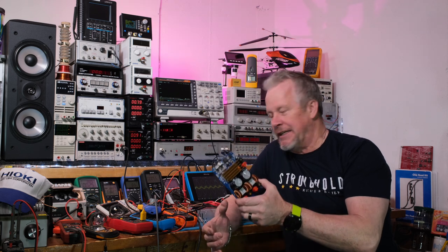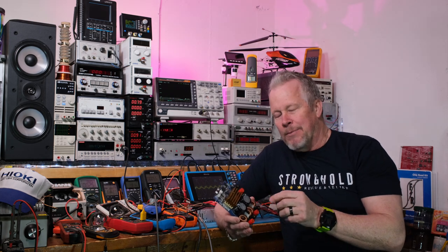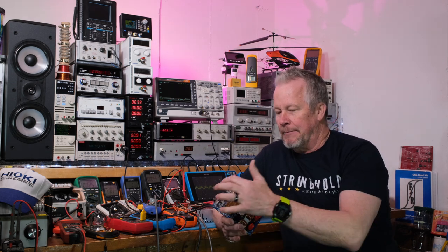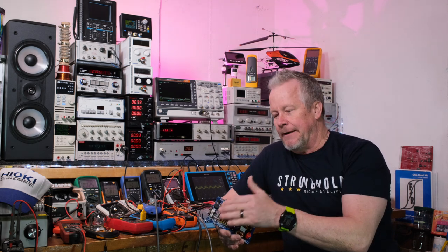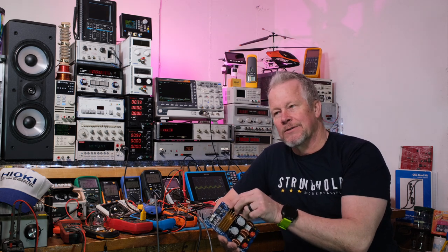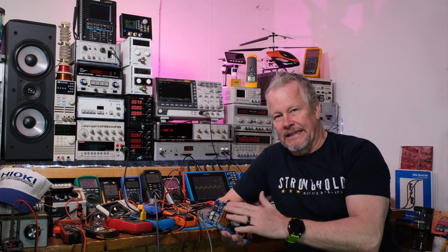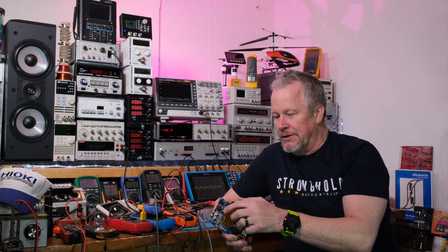I showed the data sheet on this. We've got the switching power supply and we're going to power this up. Here's the thing: when I had the signal coming into these RCA jacks and my THD meter connected, I read a certain THD — then when I applied power to these terminals, I saw the THD go up. That's telling me the noise is being generated by the switching power supply or the Class D amplifier.